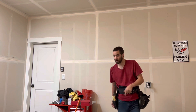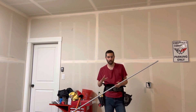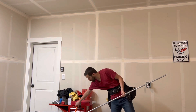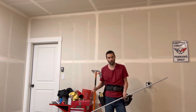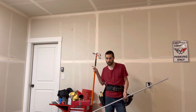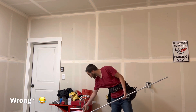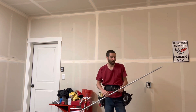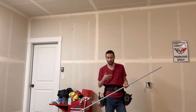I have my 10-foot stick of pipe right here. The first measurement is 66 and a quarter, but with the half-inch pipe bender there is a five-inch deduct. I'm going to be doing a 90, going straight up and taking it to the right. So instead of 66 and a quarter, it's going to be 61 and a quarter, because I'm going to gain those five inches back when I bend the 90.